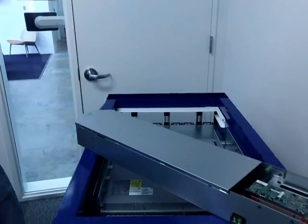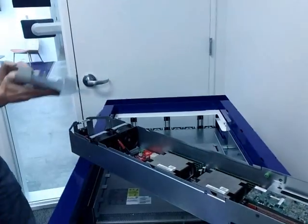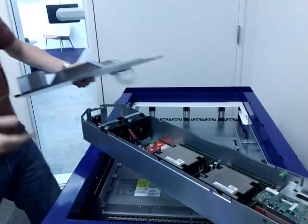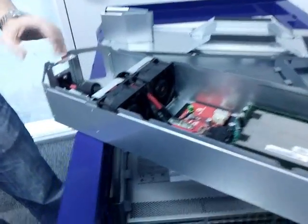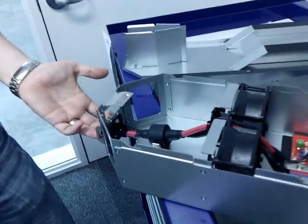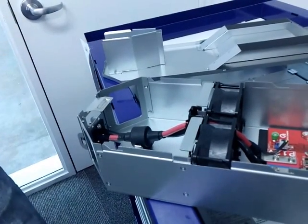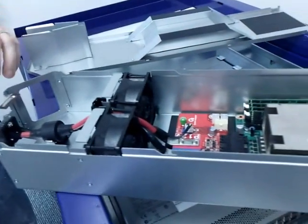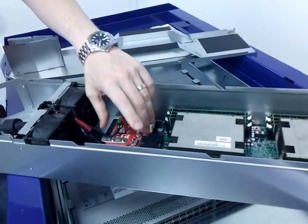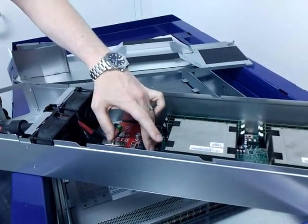First, here is our windmill compute node. This is actually just an adaptation of the compute node we're using today — a mechanical and electrical adaptation into open rack. What we're looking at here is the 12-volt bus bar interconnect, which is how it picks up power from the back of the rack. There's no power supply in this server — that's an important point — and the voltage is not converted, transformed, or regulated between the bus bar and the motherboard. The power comes in from the bus bar clip through a simple power connection board that runs the fans, and then into the power connection of the motherboard.